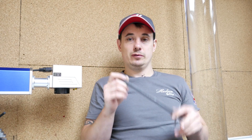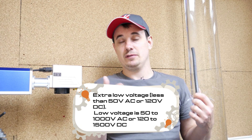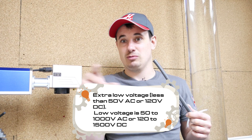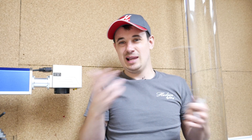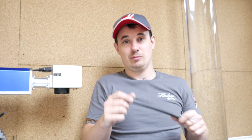SWA should be the first point of call for any low voltage installation. I'll clarify: when I say low voltage I mean mains — single phase, three phase, all comes under low voltage within the defined voltage range. I'll use 'extra low voltage' when I actually mean extra low voltage. A lot of manufacturers incorrectly use the term 'low voltage' for things like MR16s or 12-volt fittings — they actually mean extra low voltage, which is completely wrong terminology.